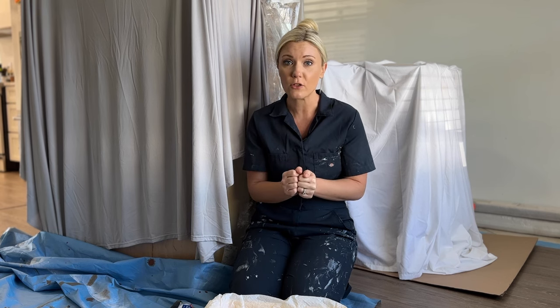I pour my paint into the tray just filling up the bottom reservoir area, then I dip my roller just a little into the paint and roll it up and down on the grooves of the tray a couple times to coat my roller. Then I roll my paint onto the wall working in about a two to three foot section, rolling in a W pattern and going back and forth filling in the empty spaces of the W. When your roller first touches the wall do not press too hard or you will push too much paint out causing streaks and drips. Instead lightly roll to begin, then gently apply more and more pressure as you notice less paint coming off. When you start to see the wall through the paint it's time to add more paint to your roller.